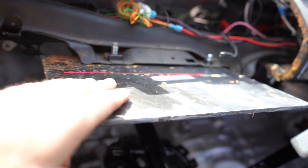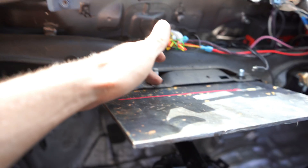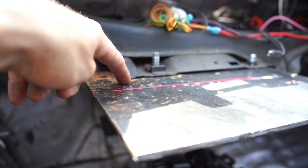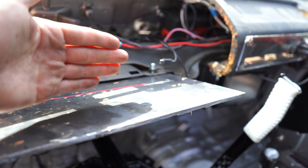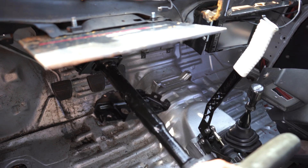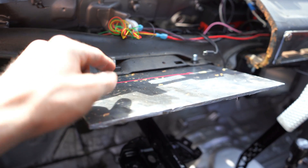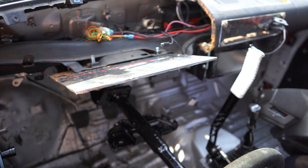I have a plate on here — this is quarter-inch steel. I drilled the hole ready just to mount it, and from here I'm going to start tracing out how much I need to cut horizontally. I also need to mock this up and punch the metal to see where to drill. I already measured — I need about two and a quarter inches from this mounting bolt to the mounting bolt on this. Let me get to it and then show you guys how far I went.